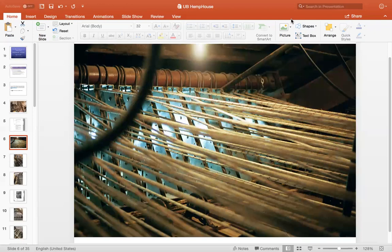One of the practices when we're running the rope through the head blocks, and again, one of the great things about hemp houses and one of the disadvantages because it's so labor intense is that you're regularly pulling all the rope out and putting all the rope back, and especially in a place where you're doing a rotating repertory where you're not relying on fixed battens.